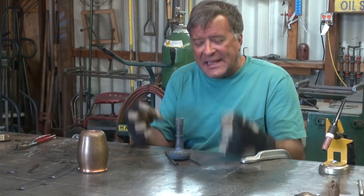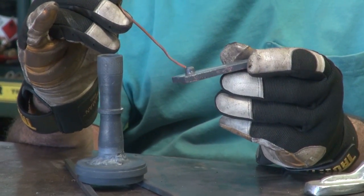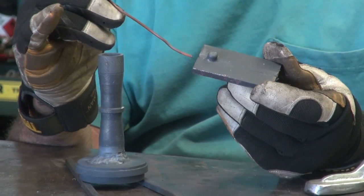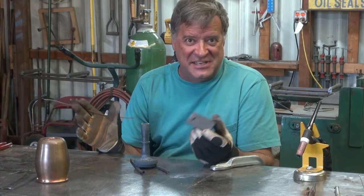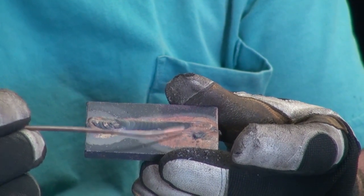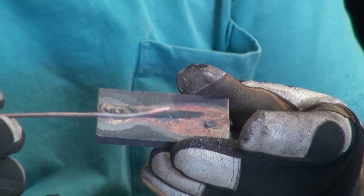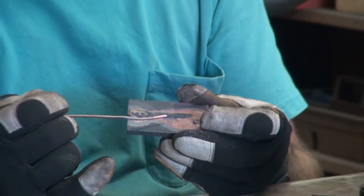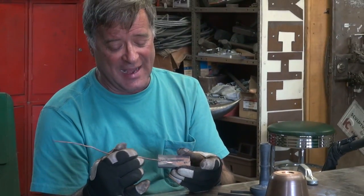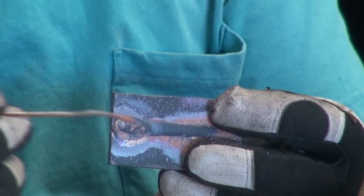It takes a lot of heat, you've really got to get on it, and then all of a sudden you're welding. See that little bump right there? This is a piece of quarter-inch copper plate I was using to check my settings. I tried a little AC instead of DC just to see what that would do — don't do that. I started on that end, got my puddle going, welding along, playing with the pedal — a little too much, a little too little — just trying to get a hang of how much amperage you need and how to control the puddle. Don't let that heat get away from you.